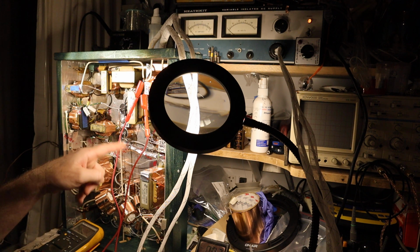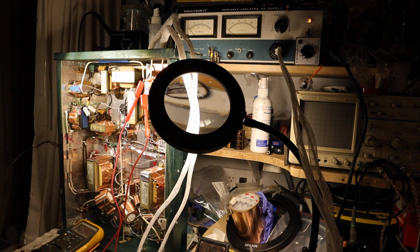So here it's very easy. I don't plug in the rectifier, and then it's not going to give me high voltage. Why is that important? Because if the filament voltages are not right, or if there's a problem with the amplifier at the heating level, you want to be able to troubleshoot that first. So step one, we want to establish that our heater voltages are correct, and there are no shorts in the filament circuit.